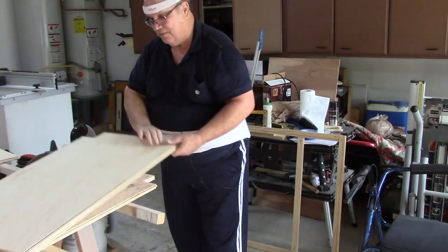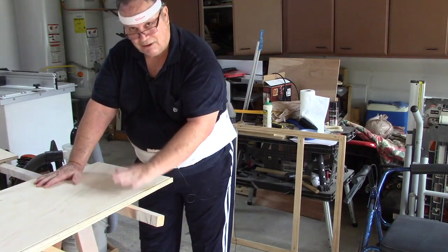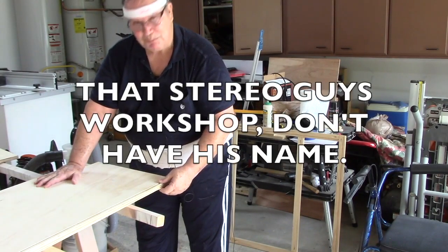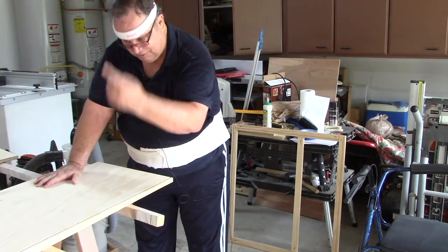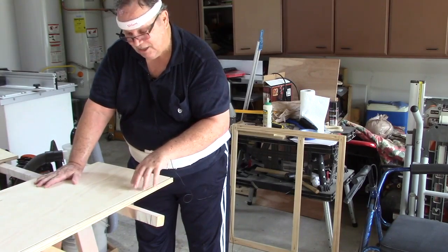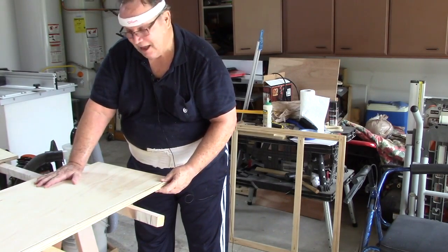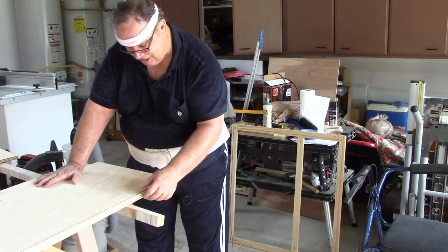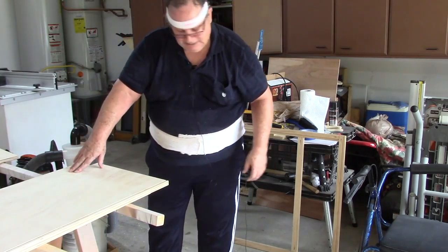Two things I want to talk about. One, I made sure that I cut my wood so I would be cutting with the grain and not cross grain. Secondly, one of my viewers said I should put blue tape down to help cut down on the chipping. I don't know if that helped — it certainly didn't hurt — but I did put blue tape down. I think running with the grain is why I got the clean cut. But for the fellow that told me that, I thank you for that suggestion. The blue tape surely didn't hurt. I got very clean cuts here. So the next thing is to set these into the face frame and glue those up.